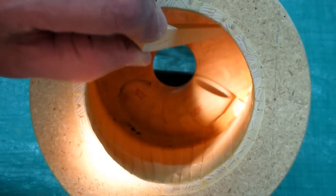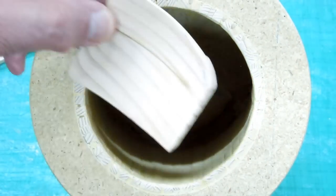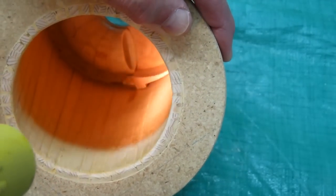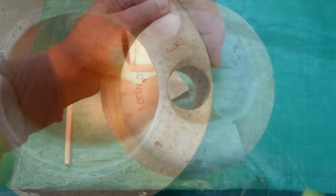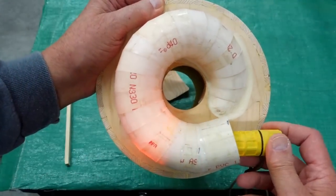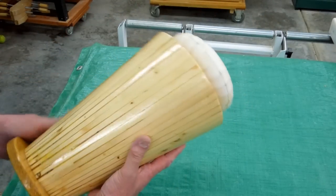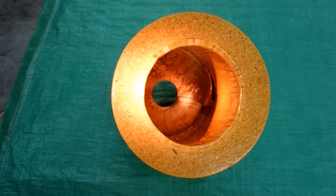While I don't think this needs any guidance to become tangential, I put a little stop block in there and made a piece of wood to go inside. The purpose of that stop block is that when I get glue smeared all over that piece of wood, it'll help me slide it into the correct position — because once my arm is inside I can't see what I'm doing; it's all done by feel. Placing a high-intensity flashlight in the entry of the spiral, the light follows the pipe around and gives a pretty good idea of how material will enter the cyclone. The cyclone has been given two coats of polyurethane — nice and shiny — and its inside surface is smooth, meaning collected material will slide around there very easily.